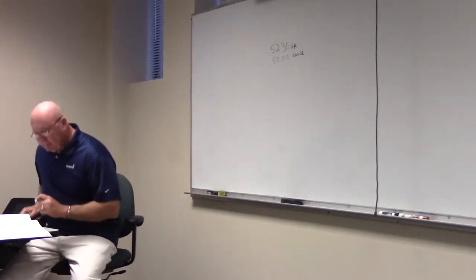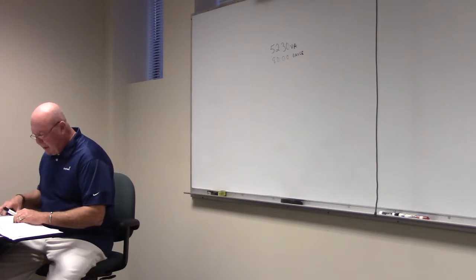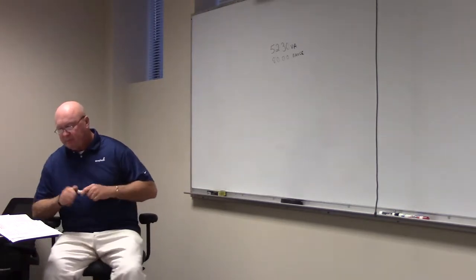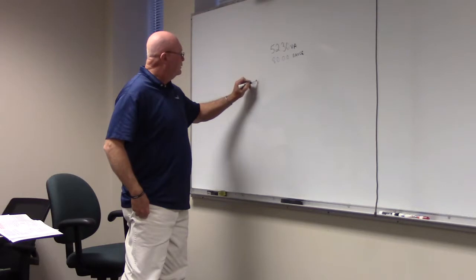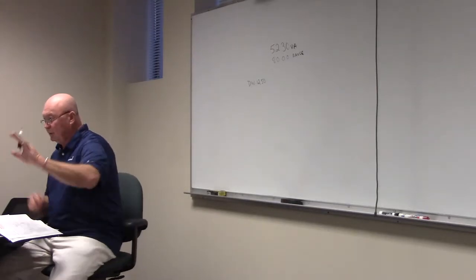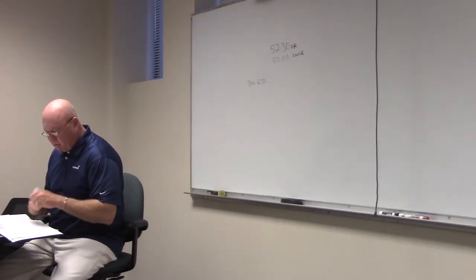Now we got to look up. Now it tells us our next thing is a dishwasher. Well, it just gives us horsepower on the dish, or actually, it gives us VAs on that, doesn't it? So we got dishwasher is how much? 1250. So let's just write that down. That's dishwasher, that's one appliance. Other than these other ones, this is something that's different. So that's one appliance.